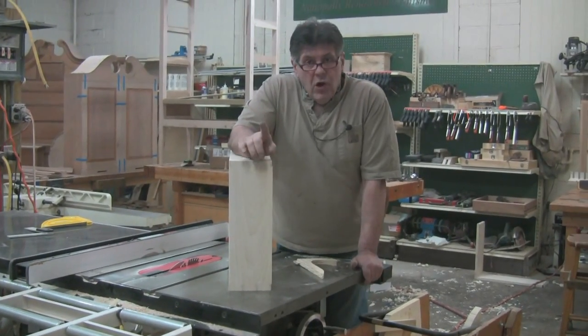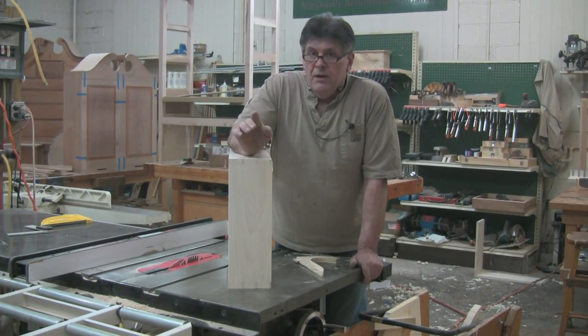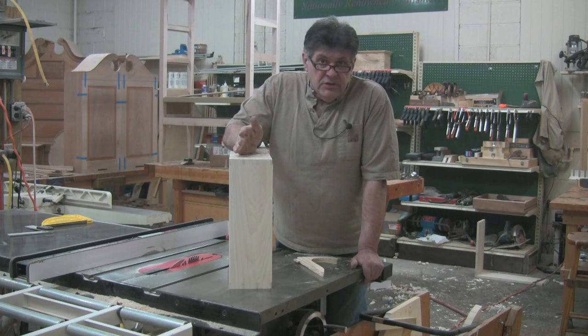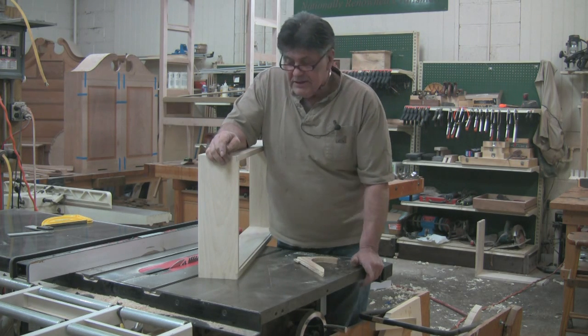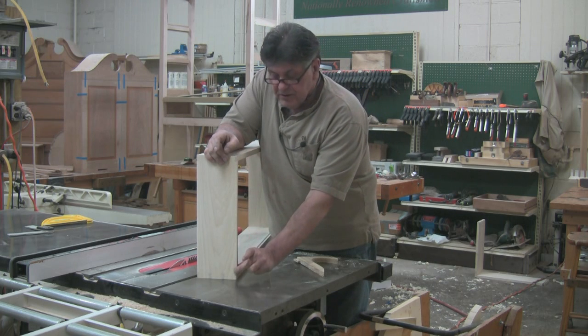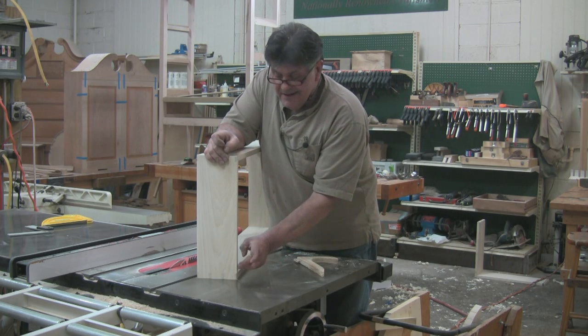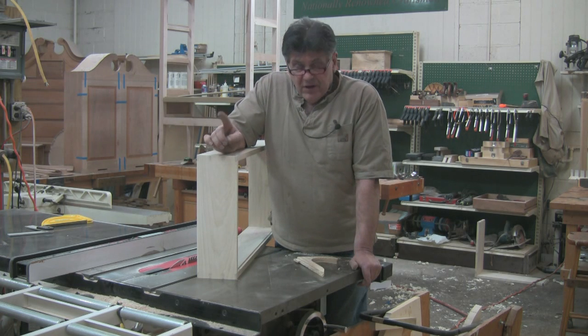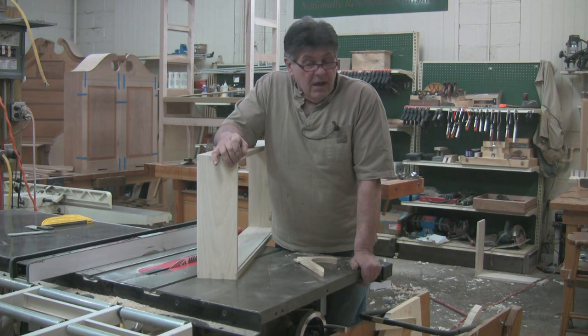If you're doing a large drawer or doing this on a table saw intimidates you, or you don't feel like it's safe for you, an alternative is, and it's exactly what I did to show you, simply cut a thin strip, again about a 1/16, and just glue it on. But when you do your drawer, you're going to have to compensate for that in height. I hope you got that. We want it just running on the runners, like a sled.